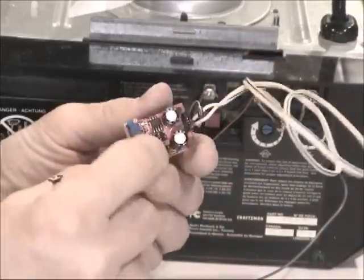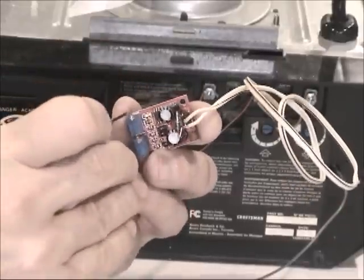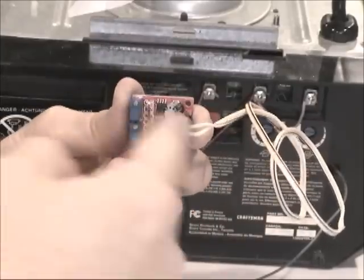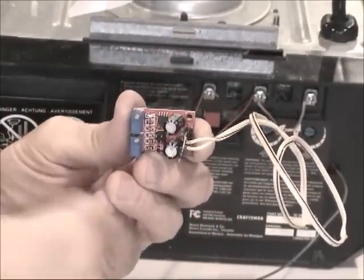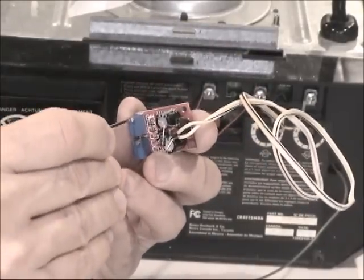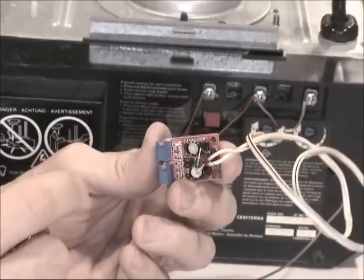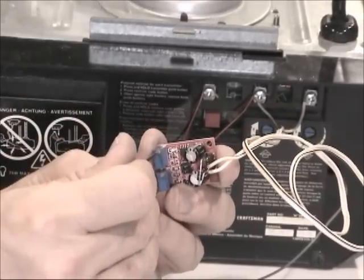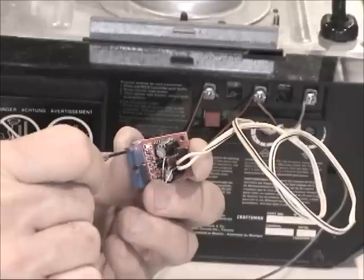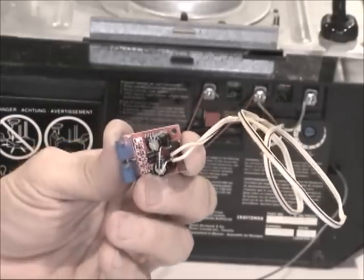Now all resistors are turned clockwise. Take one control and start turning it counter-clockwise — the other direction — until the LED goes on. When you start turning it in the other direction, the LED goes on. Once the LED goes on you have roughly 50 hertz output.